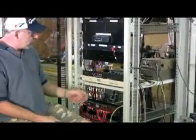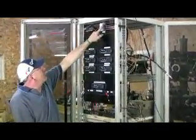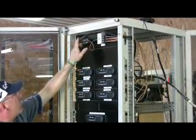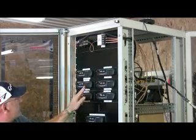We're also going to have a slide drawer with weather radio so we can use the same weather report for turning the controller on to give a weather warning. Up top here we have a multi-coupler which is bringing in a single antenna feed from the UHF antenna through a preamp and then splitting it for the various UHF receivers.